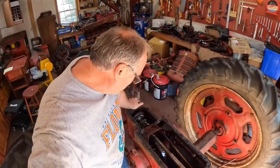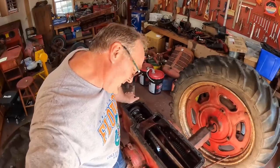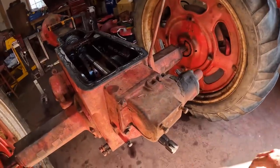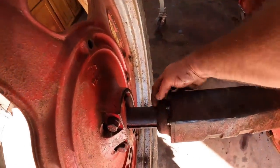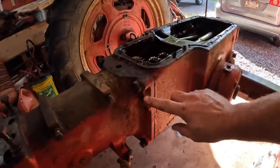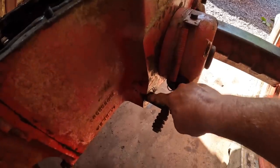The question I'm facing is, just like the engine, how far am I going to go into this? With the MD, I tore it all down to just the case. This transmission has never had any problems. The issue is it's hard to assess the health of some of the bearings without taking things apart and really looking at how much play there is. But if I ever run into a problem down the road, I can pull the lid off and work on it. I do know that I need to change all the seals — I need to pull the belt pulley and PTO unit off, reseal all these joints, replace the PTO seal, the belt pulley seal, the seals on the rear axles, probably the pinion seals that go into these brake housings — they always leak. And there's a seal on the input shaft going into the transmission that's probably leaking, and the shaft seals on the cross shaft that connects the brake pedals to both sides.